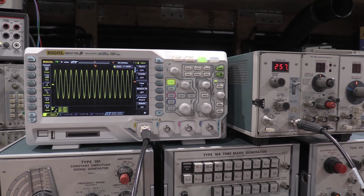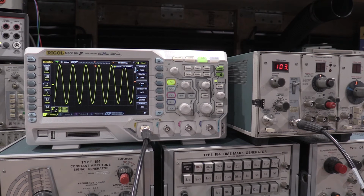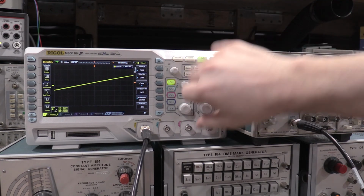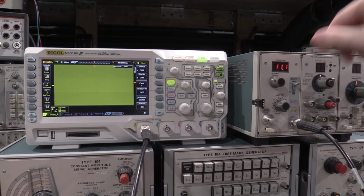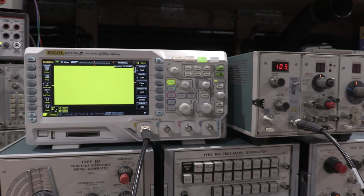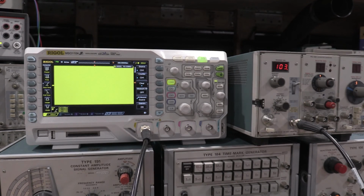See what kind of rise times we get out of it. I'm actually kind of impressed, because that's at 103 with the bandwidth off, which is still almost... let me make sure my measurement didn't get jacked up. No, that's full. So there's full. There's 103, so that's actually pretty stout for a 100 megahertz digital scope. I guess the bandwidth doesn't measure the same way. Wow. All right, fast edges.